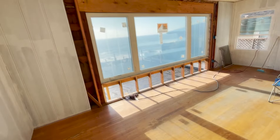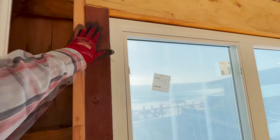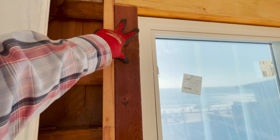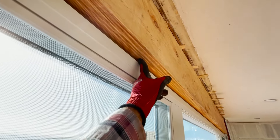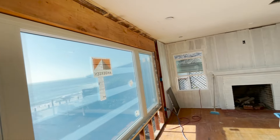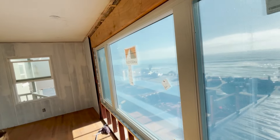This window is installed and looking good. Let me show you how we did this — we put a four-by-four for a trimmer underneath a laminated paralam. You can see it has multiple layers of plywood. This is a four-by-12 at about 12 and a half to 13 feet, and this is an Anderson window.